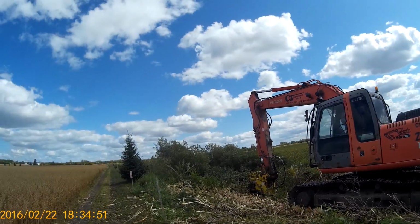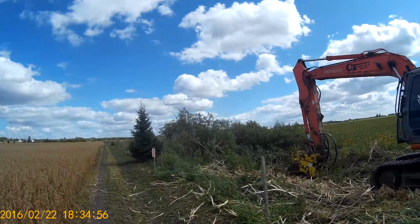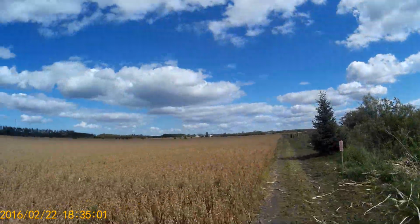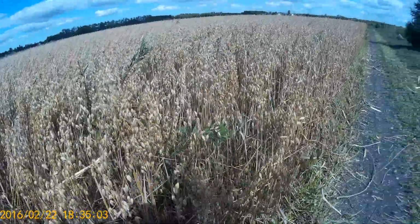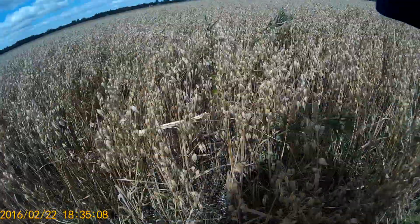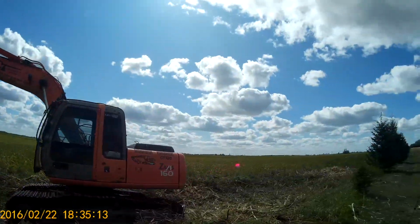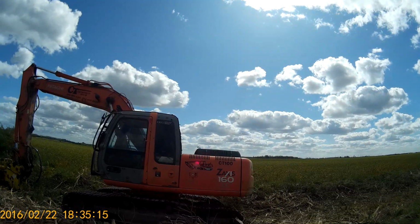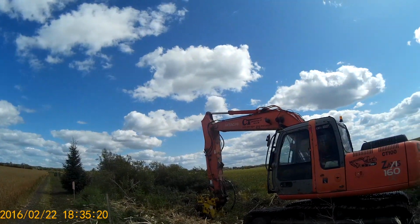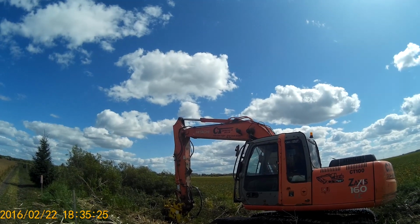Took the thumb off earlier this year because it's useless. I never use it. You always have to turn the hydraulic pressure down using a pressure gauge if you want to use the thumb, because the hydraulics are turned up so it can use the brush cutter, and we use the brush cutter more than we use the thumb. I always insist that I don't need the thumb. All I need is a wrist to twist, or anything where I can tilt the bucket. So a tilt rotator would be perfect, but this thing's an '06, so it's kind of getting beyond getting new fancy things on it.